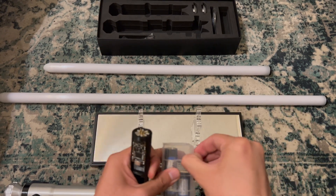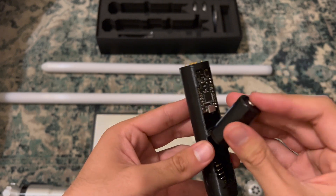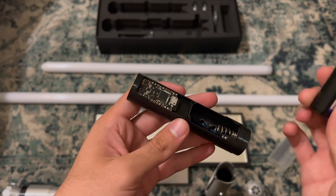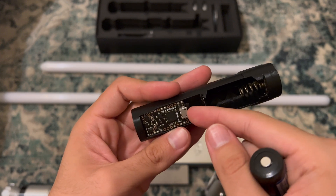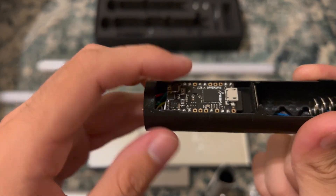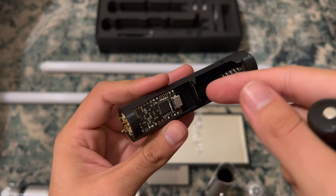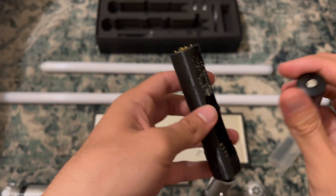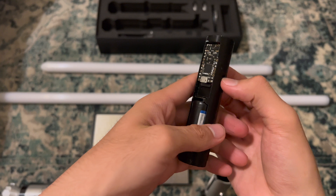You're going to want to take your battery here — negative is a spring, positive is towards the board. Something important to keep in mind: do not ever plug the Proffie board into the computer while you have the power on or the battery in. I've heard you can fry the board, and obviously you want to avoid that. I would buy a 90-degree micro USB — that way you never have to slide this out. But how you do that is you just slide it a little bit along these tracks, and then if you slide it more you can pull it upwards. Definitely get yourself a 90-degree micro USB so you never have to do that except for maybe accessing the SD card. If you take the board out, be careful — don't pull too hard and don't strain the wires.